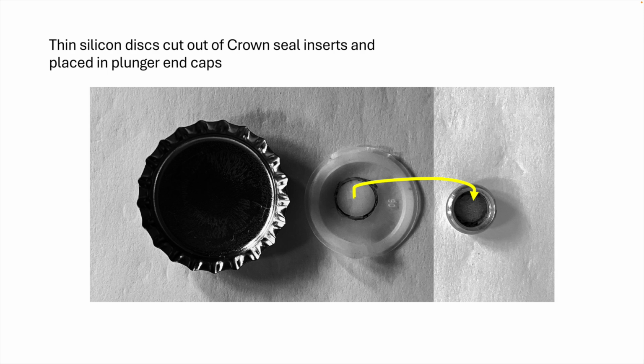A word of warning: it's possible to take the end caps off while the shutter's whole, but I don't recommend this. You could snap the brass screws that hold it in place, as I did and others have done. Once you've sealed the caps, you should have a reliable, but perhaps not accurate, set of shutter speeds.